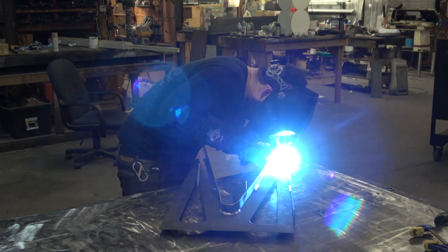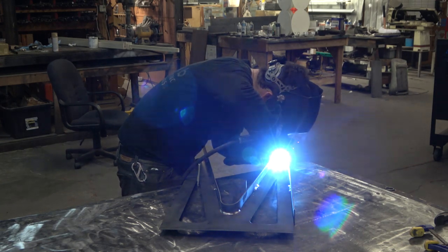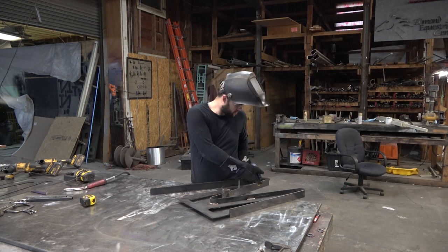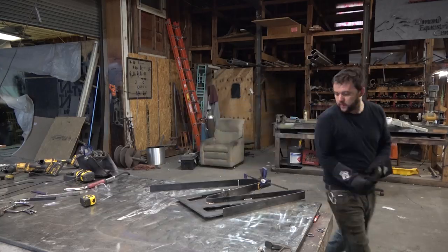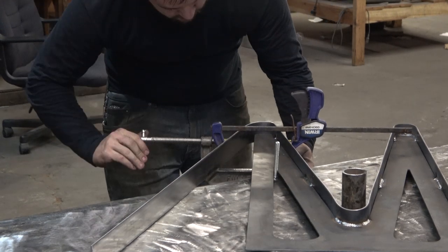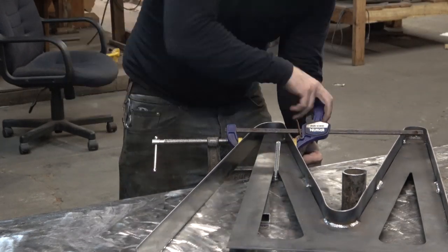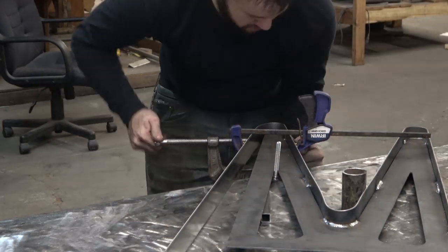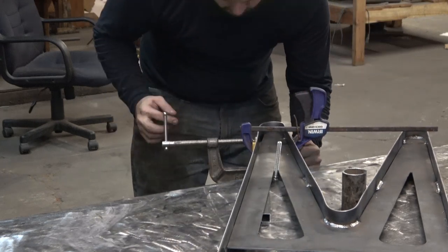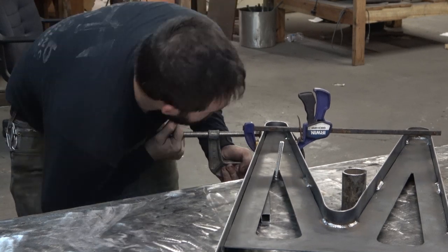As we work the strapping — the eighth-inch by two-inch flat bar — around the piece, the two big things to watch out for are: one, don't put a kink in that strapping. If you grab way out away from where you're trying to bend it and pull real hard, it's going to be easier to make the bend but you'll find the weak spot and put a kink in it. If you try and grab too close, you're just going to be pushing way too hard. You've got to find a nice balance, and using C-clamps or other clamps to aid in that is definitely the way to go.